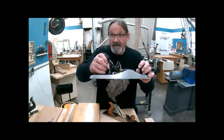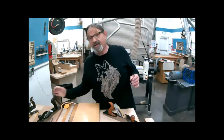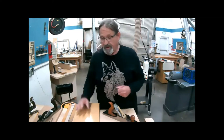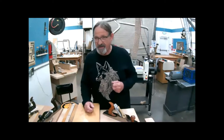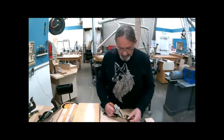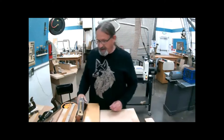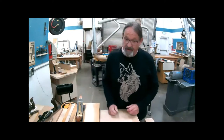This low angle jack has a much lower angle - twelve and a half degrees - which can present challenges if you don't have the different blades. With the standard blade, if you go against the grain it'll rip it up and really make a mess. But if you go the other way, as you'll see in a minute, it does good work. Jack planes are nice - I find I use them and block planes more than I use the standard number four, or actually a number three.